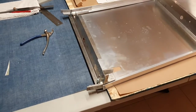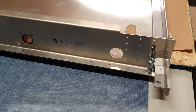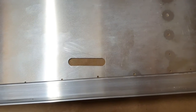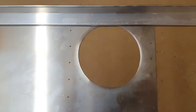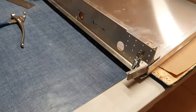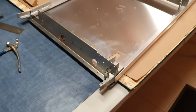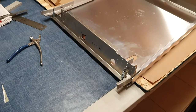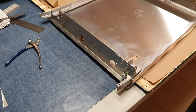After a couple more hours, the fairlead blocks are riveted on and they've gone on nicely. I've cut all the holes in the right-hand side skin: the hole where the flap drive goes through, a little hole for the rudder wires to go through, and an inspection hatch as well. I've also put the 10-degree bend in at the front — the sheet fitted nicely in my bender and only took a very light amount of pressure. I slightly overdid it, so I've flattened it out slightly.